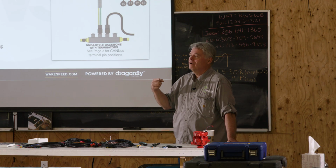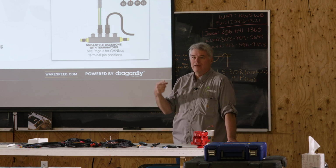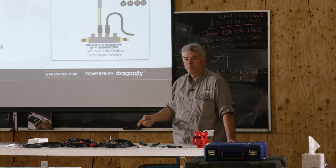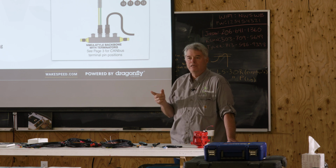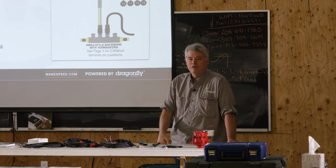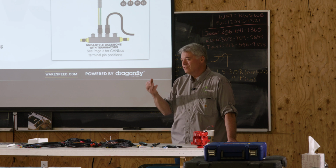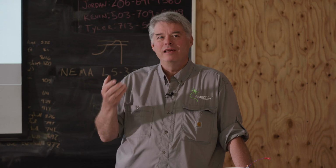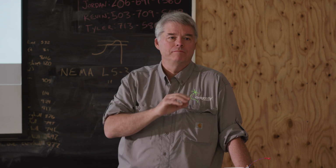You will hear in the best resource in the world, AKA the forums on the internet, that lithium batteries don't need to have battery temperature sensing because we don't do temperature compensation. Well, they're right about the latter. You don't do temperature compensation, but there's a reason to sense the battery temperature. If that battery gets too hot or too cold, the Wakespeed will stop charging.